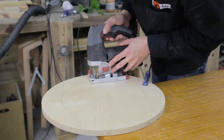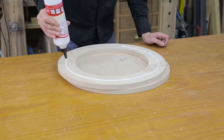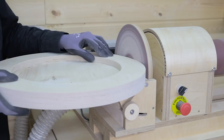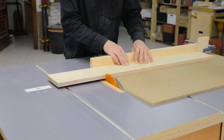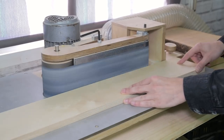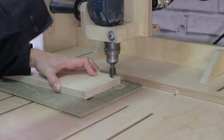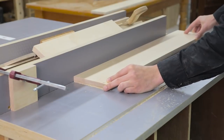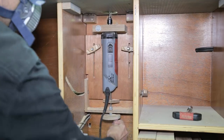I cut the bottom piece again. This recess will house the weight plate that will act as a counterweight. Now I can glue the two bottom pieces together. I cut the rest of the stand's pieces and use this opportunity to sand all the edges. With the router, I make grooves to lift the support when needed, running it through twice to avoid pushing the router too hard.